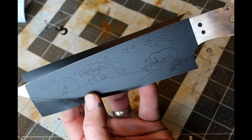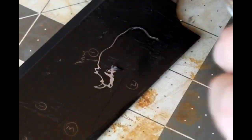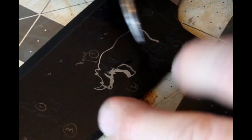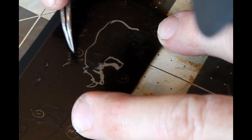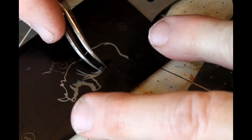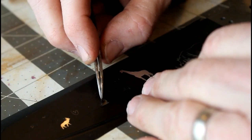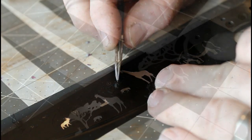That gives me the location so that when I drop this vinyl onto the blade, it's going to be placed exactly as I originally drew it. Here you get a look at the cut vinyl in place on the blade. Now I'll mask off the back of the blade and any exposed metal in the front and on the handle. Because this is a multi-tone etching, I've actually marked them in pencil — the darkest areas are number one to be etched, the next darkest is number two. I'll start to peel away the darker areas, which in this case is going to be the outline on the rhino, as well as the trees, the giraffe, and some of the other animals. Any items you remove the vinyl from will get etched; the rest will be left shiny.